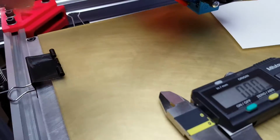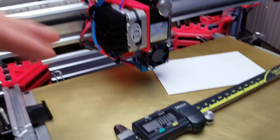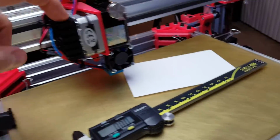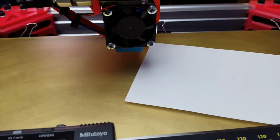It's good to go. Had to calibrate the steps per millimeter. Apparently, with the Core XY setup, you have to double each stepper value, even the Z and the extruder, even though you'd think it would just be X and Y just due to the way that the motors are doubled up. But I digress. I want to talk about the bed leveling situation here real quick.